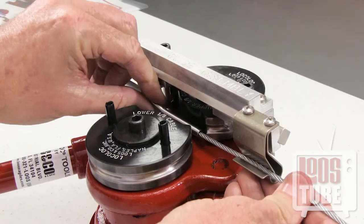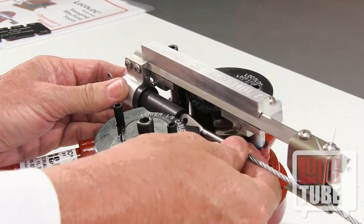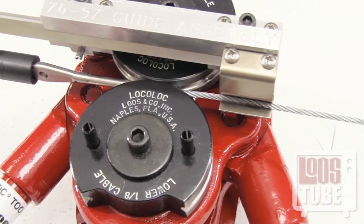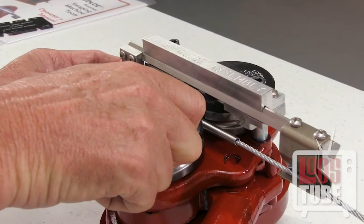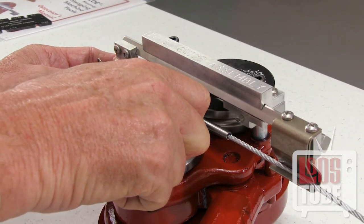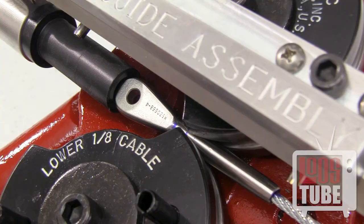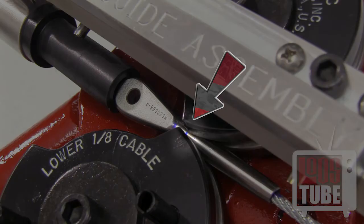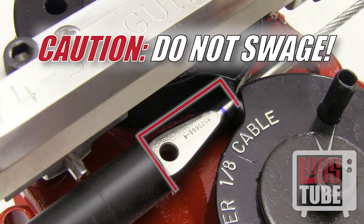Be sure that you can see your point C marking from earlier. Also keep in mind that the length of cable needs to be supported. If there is too much slack in the cable, the resulting swage may not be straight. Now grasp the pins on the lower die and turn counter clockwise, making sure to align the points of the dies on point C. If you begin the swage at any point above point C, you risk significant damage to your tool that may result in costly repairs.